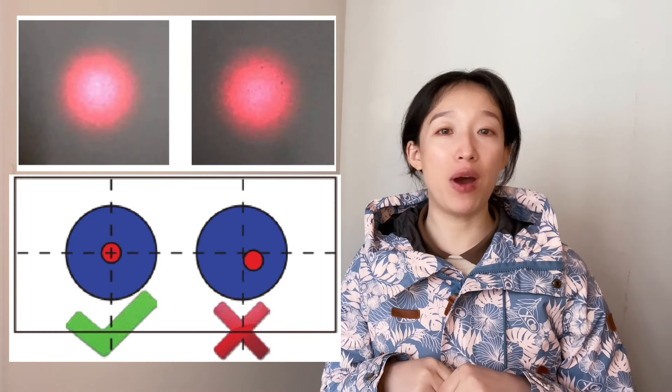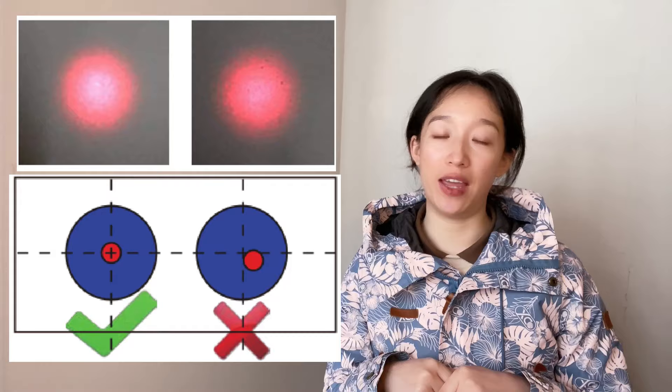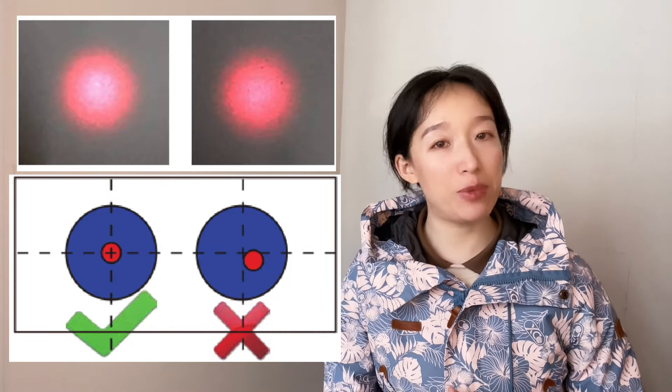Fourth, optical checks. After the temperature of the water cooler reaches the set value, we can turn on the power of the laser equipment. Observe whether each indicator light is normal and whether any alarm is generated. Please do not perform laser emission or cutting or other operations immediately. We need to check the red light and see whether the lenses are clean and centered. If you are not sure about the steps to check lenses and nozzle, please check my previous videos on lenses and nozzle.